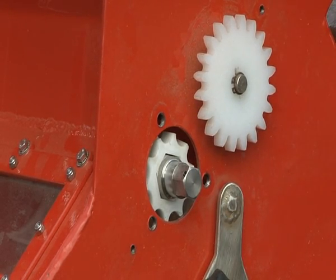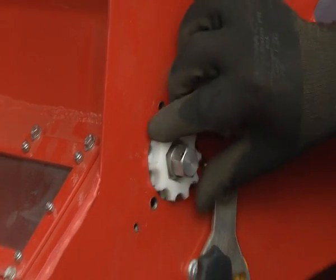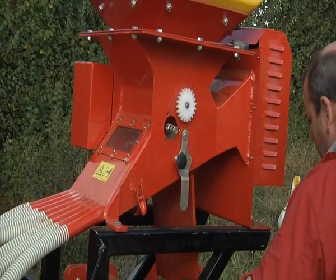The seed rollers are now removable by sliding along the shaft and through the casing of the seeder unit base. This is achieved by putting your arm up through the open seed hatch.